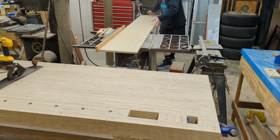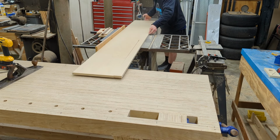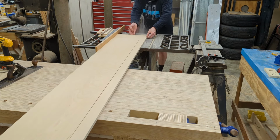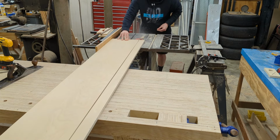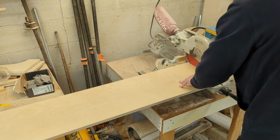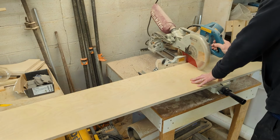A leg vise normally has the leg as the base of the vise, but in a Moravian workbench, the leg vise has a separate base that the main screw nut will mount to. My first goal is to cut and laminate 5 layers of plywood for this base.